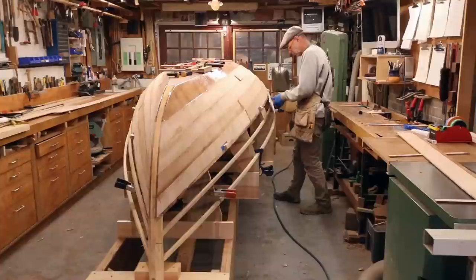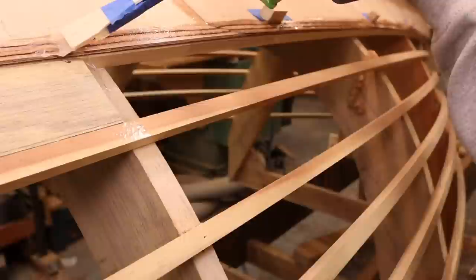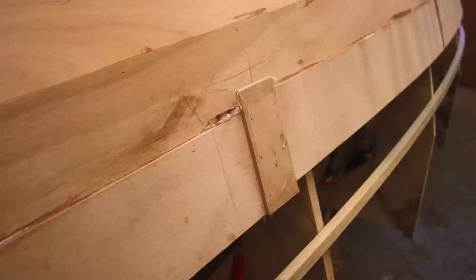Working smart is primarily about being able to think a few steps ahead to anticipate what you're going to need. A great example is knowing I would need a backing block for all of these scarves, so by making backing blocks up ahead of time and taping them directly to the mold where the scarf is going to land, it saves me having to fumble for them later and allows me to just use a small clamp pad that I can nail directly over those scarves with our pneumatic nailer. Probably the smartest way to work is not to constantly innovate, but to find techniques that make sense for the way you want to work and then refine those techniques until you're very efficient at them — that's what you see me do in my skin-on-frame kayak building videos. Join me again next time when hopefully we'll work smart in the next episode of building the Catalina Wherry. See you later folks.